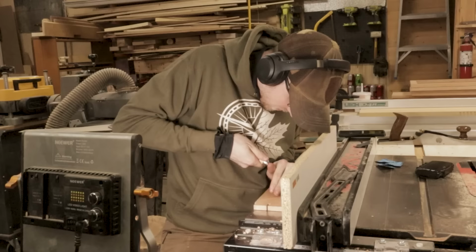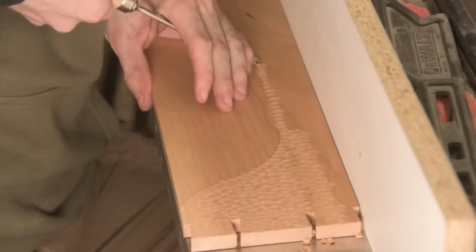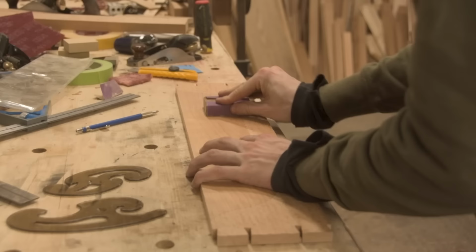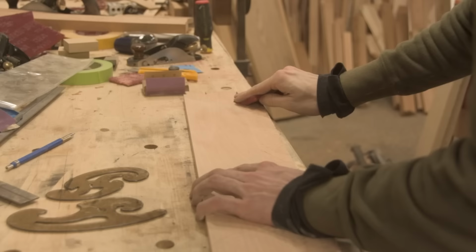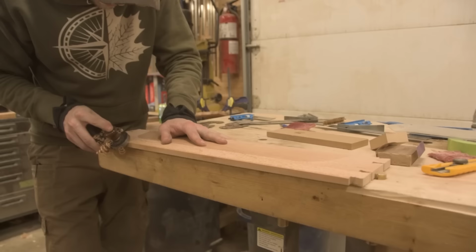And this helps bring in just a little bit more balance. If you look at our side pieces, how we have that walnut that is nice and clean and flat, you know, we don't have any texture to it. It's just clean, straight grain. Then we're combining that with that stippled cherry piece. And we want to create that same or a similar look on these longer side pieces. So by combining that flat cherry on the top there with that stippling along the bottom, that just helps blend the texture. Because when you're adding texture to a piece like this, it's all about finding balance between the clean wood that we're used to and the texture that you've decided to add in.